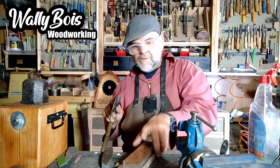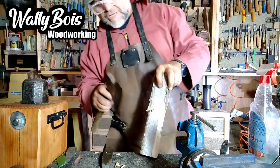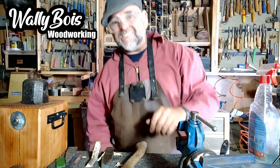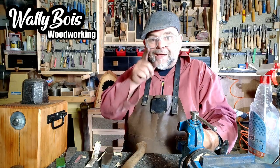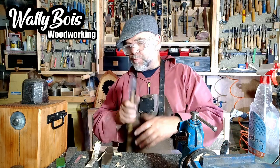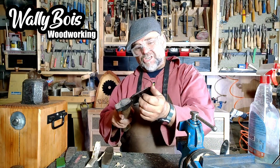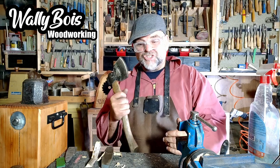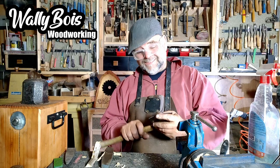That's cutting and scraping at the same time — so that's how I sharpen my carpenter's axe. As you can see that is plenty sharp enough, and that's seasoned timber. Green timber is the best to use if you're doing spoon work — birch is quite good for spoon making. That's how I sharpen my carpenter's axe — all by hand, no jigs. When you use these things in the field you don't have facilities for jigs, so you've got to learn how to do it by hand through muscle memory. Practice, practice, practice.